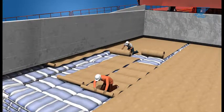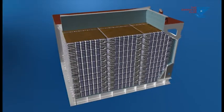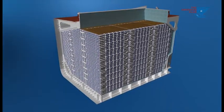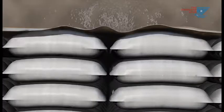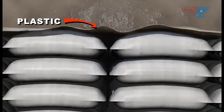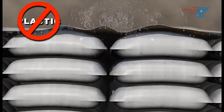Once completely loaded, the cargo should be covered with craft paper. In order to gain maximum advantage from this system, it must be carefully laid. Nylon plastic sheeting should never be used to cover cargo as it traps any moisture in the cargo. Condensation may also form on its under surface and drip back onto the cargo, damaging it.